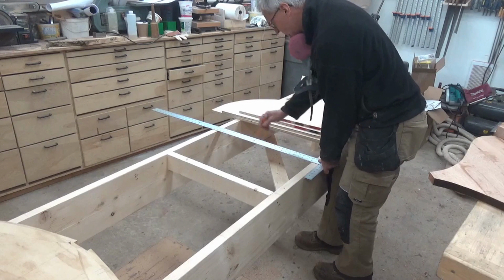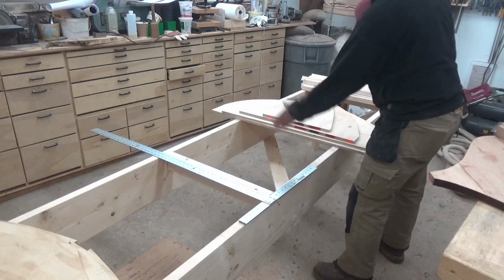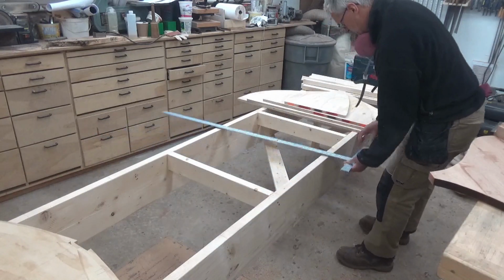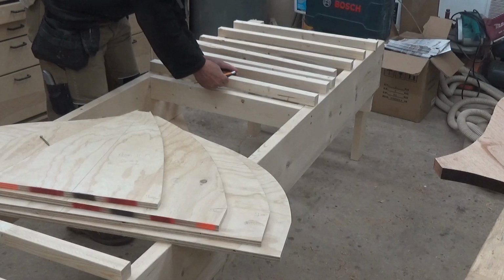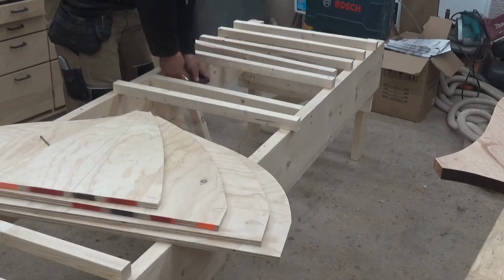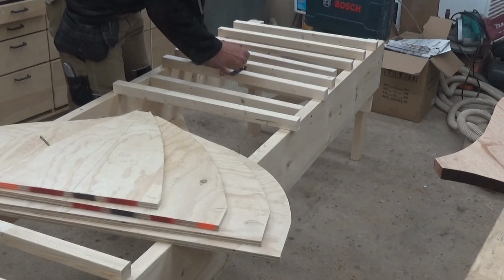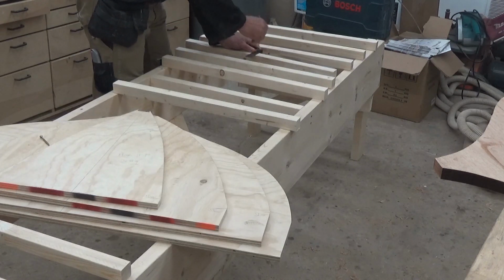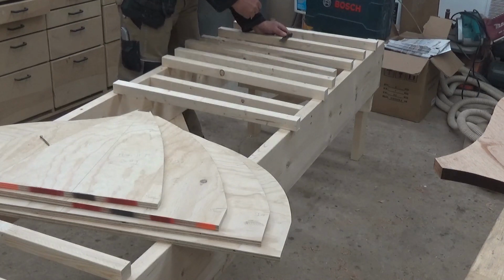With my large framing square, I'm just going to mark all the station locations, going straight across. I've cut 9 2x2s at 27 inches long. That's going to span across the strong back. I have determined center at 13.5 inches, and now I'm going to mark a square line across so I can line up this center line on my 2x2s with the center line on my forms.